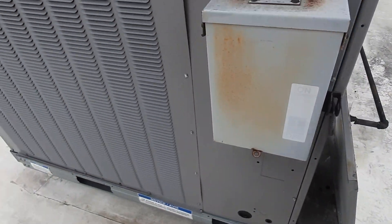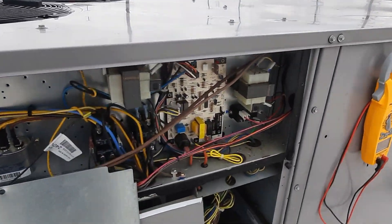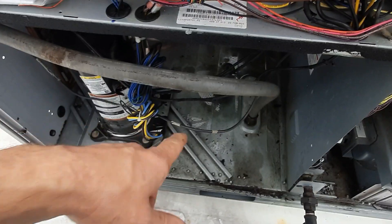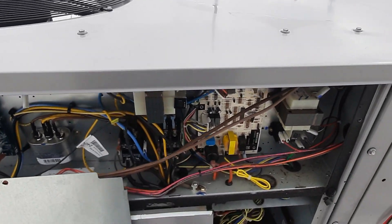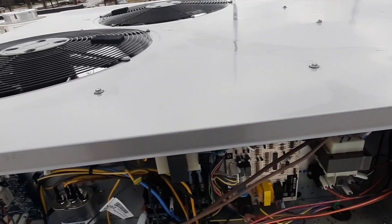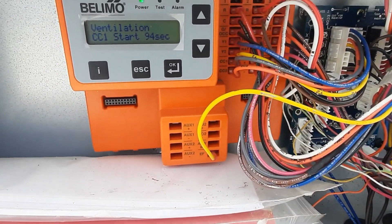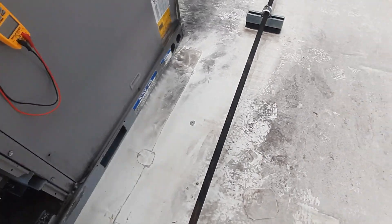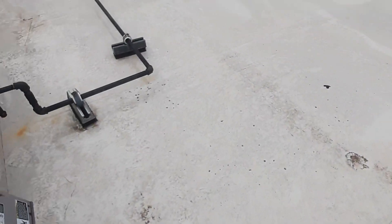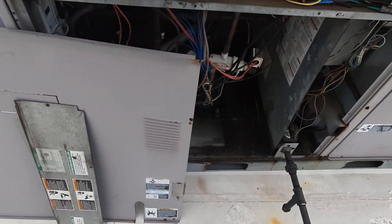We got a new fuse in - let's see if this thing blows up. That was my blower. I just disconnected the compressor there and taped it up. We can come in and disable that contactor too, but I want to make sure both my fans run. All right, so we got fans. We got a little bit of economizing going on. At least I got a blower moving some air - still a little humid today for the economizer, but we're supposed to get cold again the next couple days so it'll be able to economize.